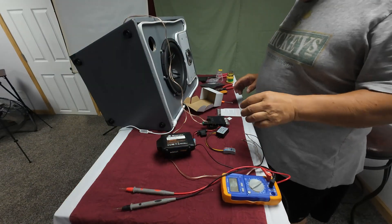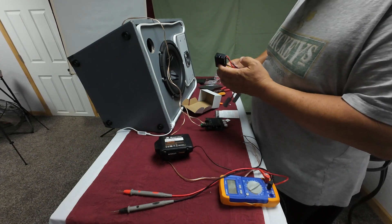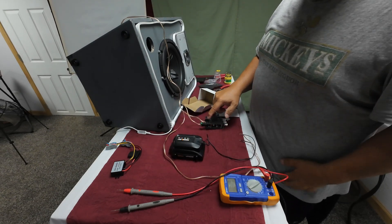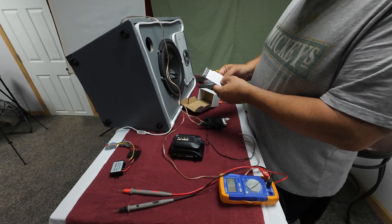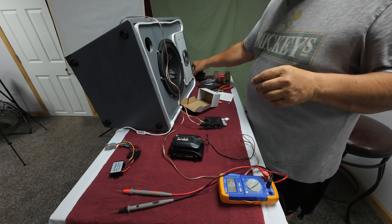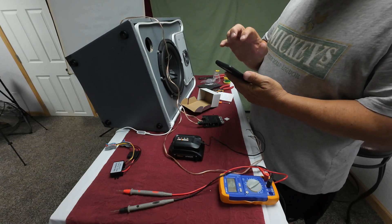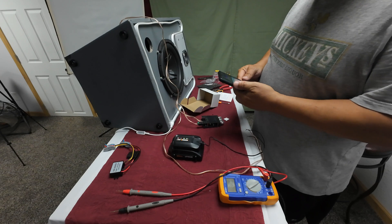What we had here was this wired through the converter. But I don't know why I didn't think of this before — we don't need the converter. We can wire directly into the 20 volt because this amp takes 9 to 24 volts input. At 20 volts we're getting almost full power out of it. It actually sounds better even.